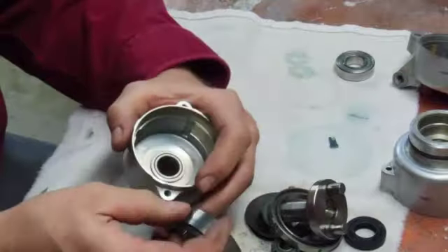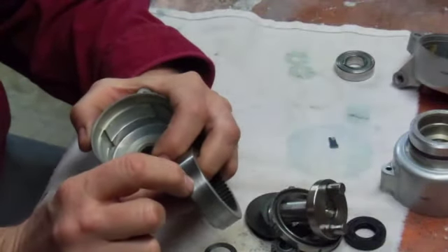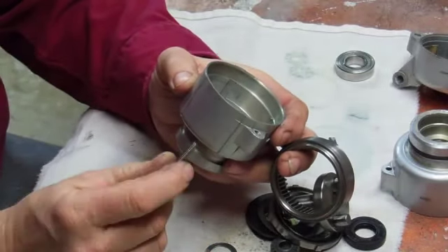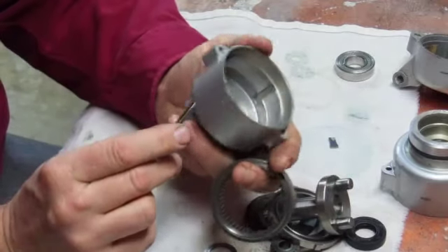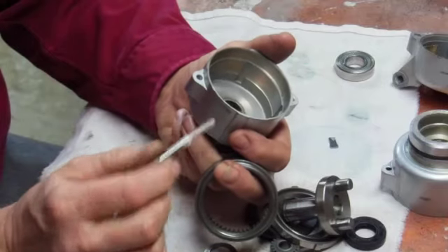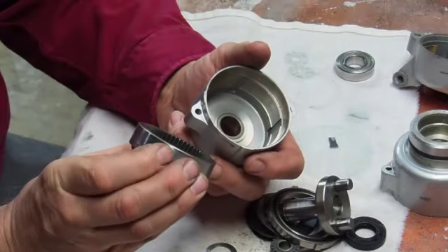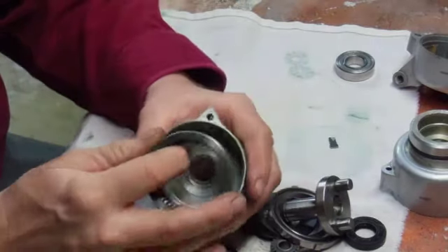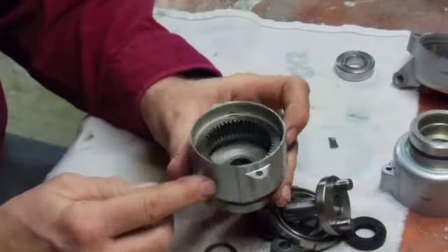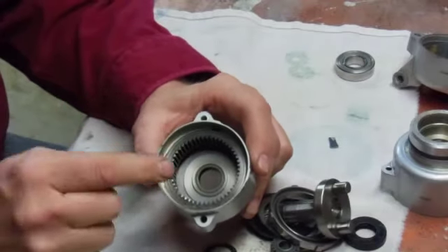What we do is, at a point in the case where we are halfway on this ring gear, we're going to drill some holes — four of them. I'm going to tap those holes and we're going to use a set screw. There's also going to be, on each of those places, four little drilled indents in here. So that when we've got this together properly and we've got our set screws in, holding this ring gear from turning, we're going to solve this issue.